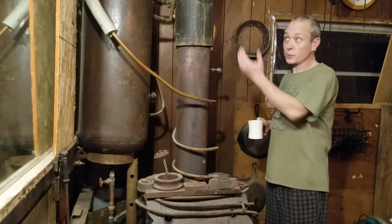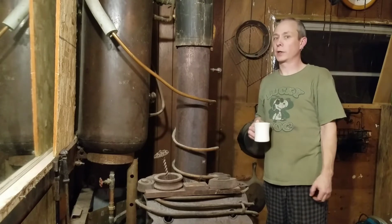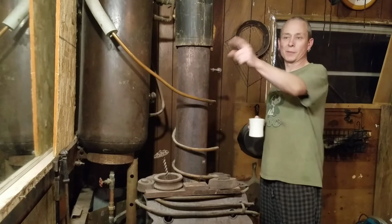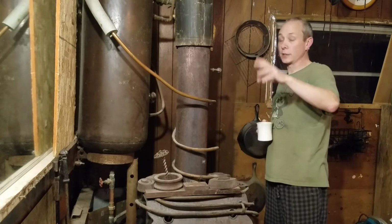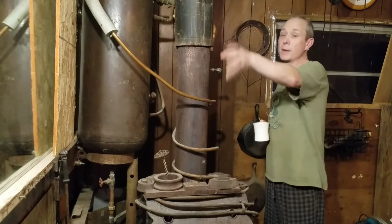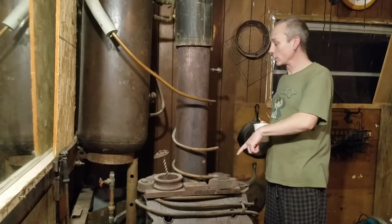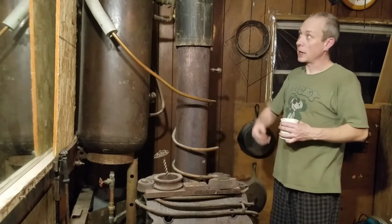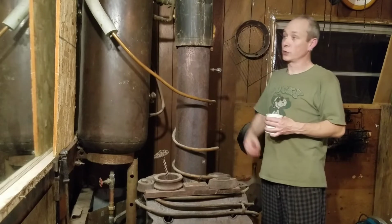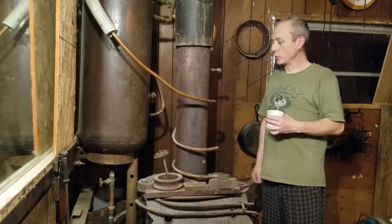Well, it turns out this makes up to 150 degree water, so I figured, well, it'll make all the hot water I need if I'm careful. So I plumbed in a set of valves in the next room next to the tank, next to the hot water heater, so that I could bypass it. So now I actually have the hot water heater turned off. As long as I'm using this stove, this always has hot water in it. And it's a 35-gallon tank. It's enough to take a shower because you use cold water with that. And it's certainly more than enough to do dishes.